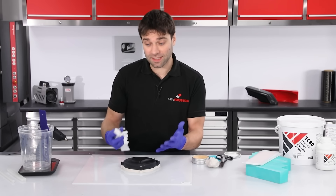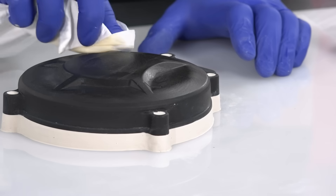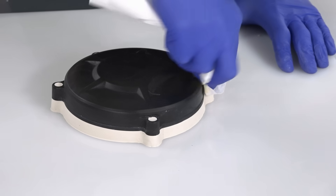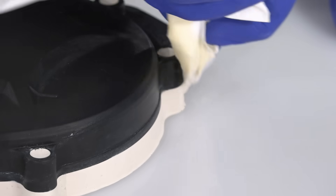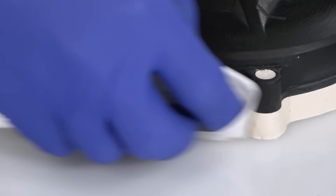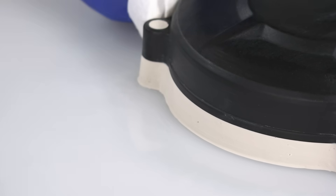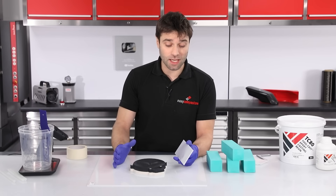Once I've finished with the main plasticine work I'm just going to go over the whole lot with the release wax again. That'll clean up any plasticine off the surface of the pattern and also give me a chance to smooth in some of the plasticine around the outside, because getting these areas completely smooth and level is absolutely critical to ensuring that your two mould halves will release easily. Now that I've got the part prepped, we can go on and make the barriers or dams around the outside.